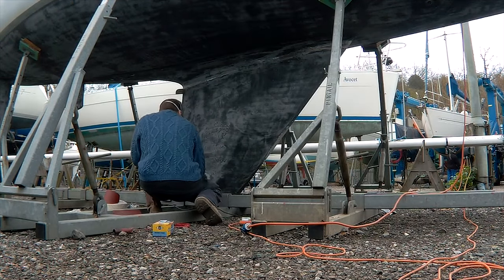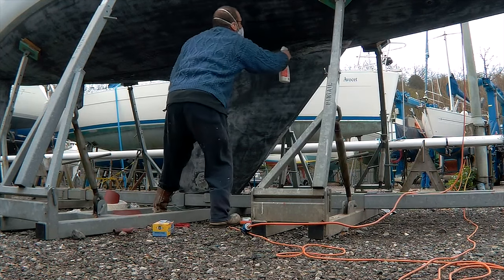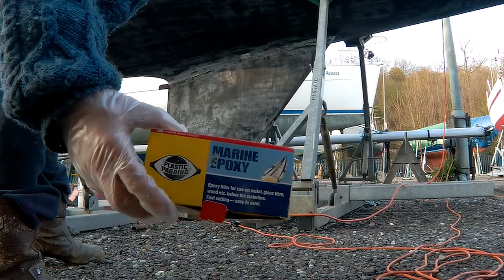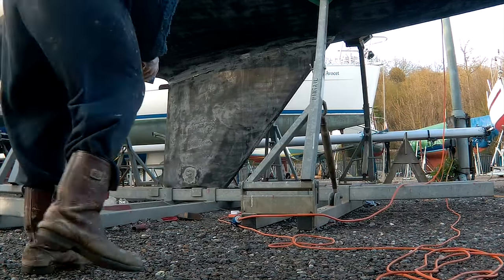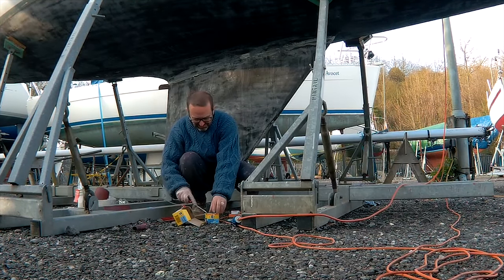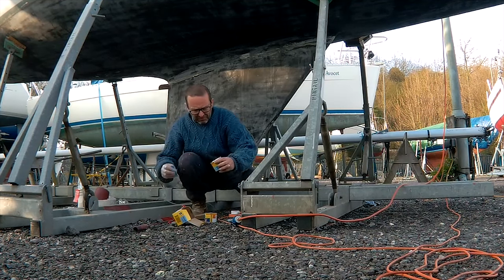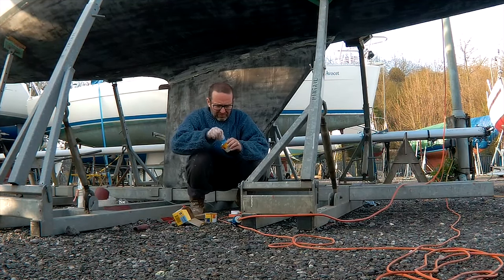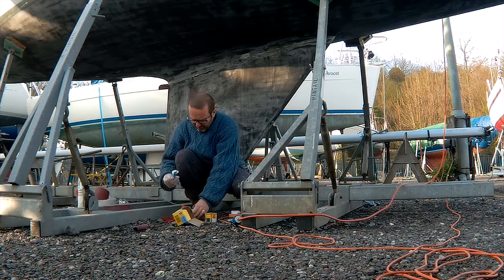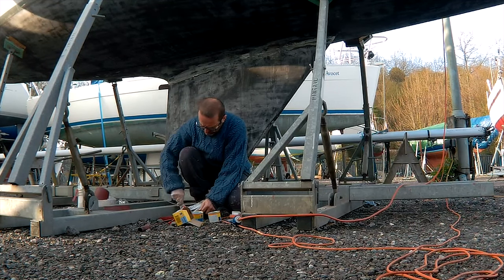The keel was sanded to a fine hydrodynamic finish, which is great, except in one place some of that filler has chipped off — that's the rusty spot on the bottom of the keel. Where the keel meets the hull, they just used the same filler to fair in the joint with no flexible membrane of any sort. No matter how good a job they've done fitting the keel, as time goes on and you're sailing, the stresses of bouncing over waves cause some flexing, and you only need a hairline crack for water to get in — and what you see is the result.